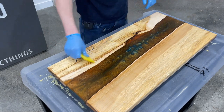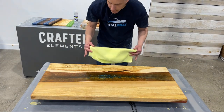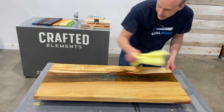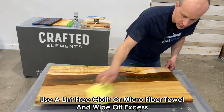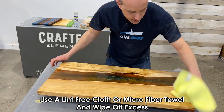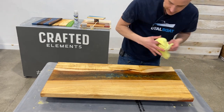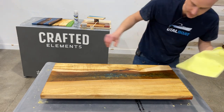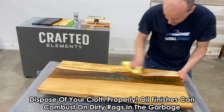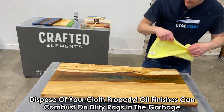We've got enough material on there. We're going to wait 10 minutes, come back, and buff all that off. It's now 1:24 PM — time to wipe it all off. Get a lint-free cloth like terry cloth, do a quick wipe off, then do a real nice buff. You can do this by hand with a cloth or use a power buffer. Keep in mind that like all oil finishes, you want to safely dispose of these cloths — the hard wax finish in the cloth isn't easily washable, and these oil finish cloths can combust in the garbage, so you don't want your shop or house burning down.